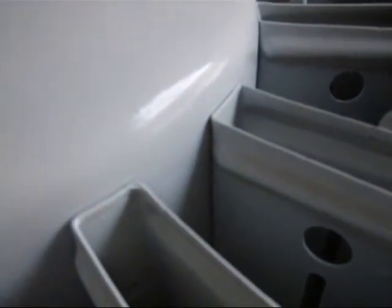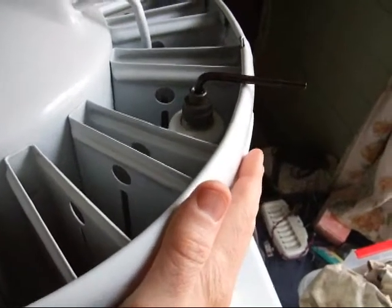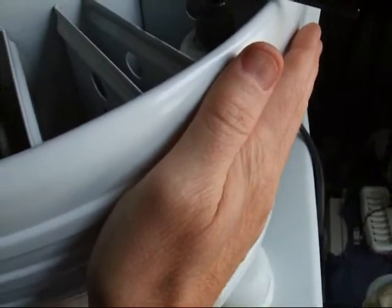You can hear that the rattle is starting to become a bit more pronounced. I can feel the condenser warming and also the top of the compressor dome. The bottom of the condenser is rather cool. That's not necessarily an indication of non-condensable gases under normal running, but when the fridge is under load and the bottom is much cooler than the top, that does make one suspicious.